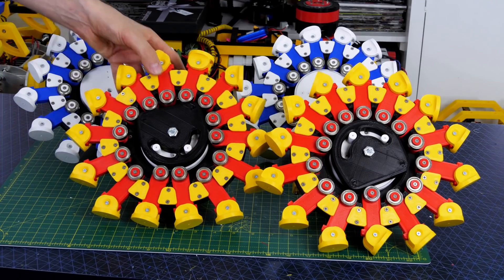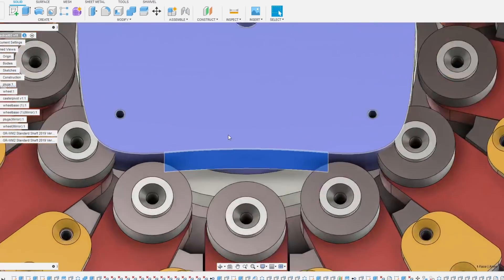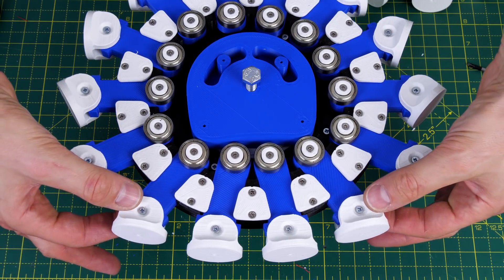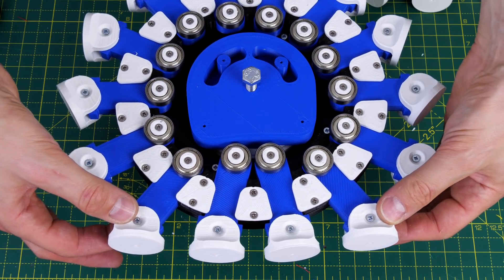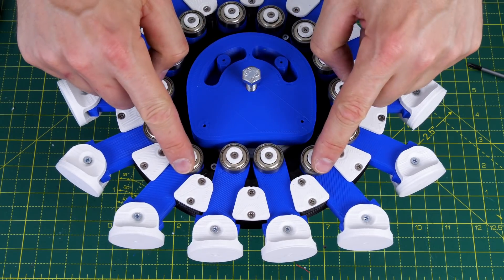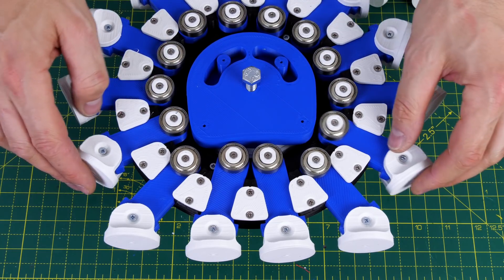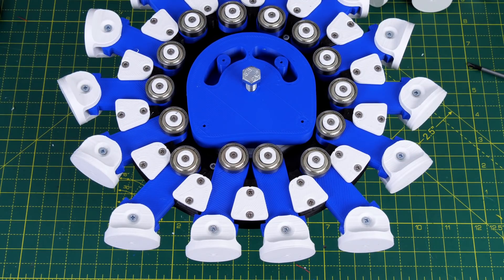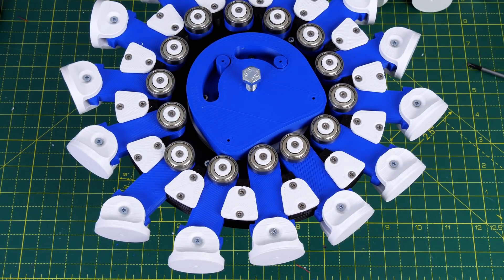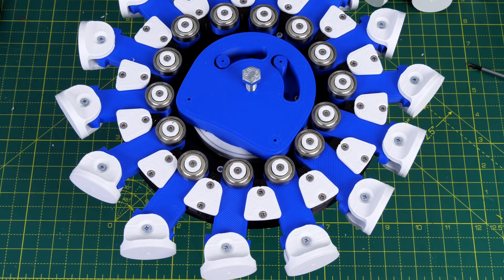So now I've made 2 wheels we've got 4 in total. One of the improvements from last time was to put a slightly concave feature on the bottom of the guide, which should allow all the feet to run properly on the ground. However, the legs won't actually move that far and it would need a much bigger recess to align all of those bearings in a straight line. One of the problems was the feet hitting the side of the guide and moving it in the wrong direction — it should slope uphill but sometimes it gets caught the wrong way and that causes problems.